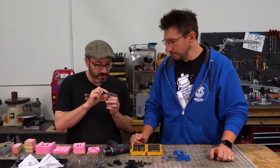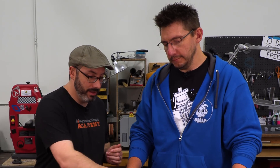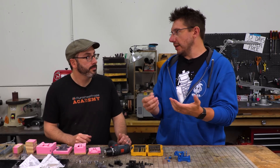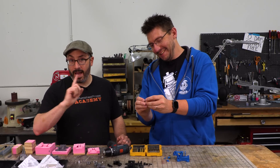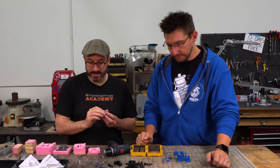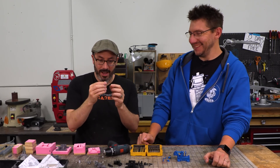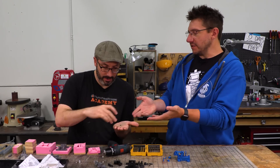The files came with little bits for the hardware, and Joel printed his in Hi-5 Blue from Proto Pasta on the Prusa i3 Mark III — it's a good material. PLA is rigid but isn't the most impact-resistant and not the most robust against temperature swings. Bill also printed similar parts on the Form 2. That teeny tiny part — instead of molding and casting those small parts, Bill machined a copy out of steel on his hobby lathe, which is obviously much more durable. It was actually quicker to just put some bar stock in the lathe and make them.